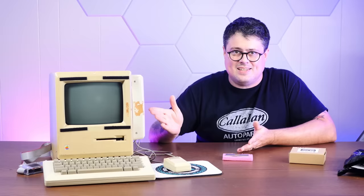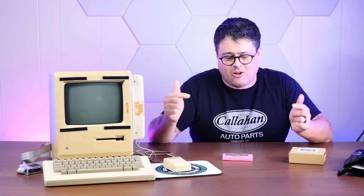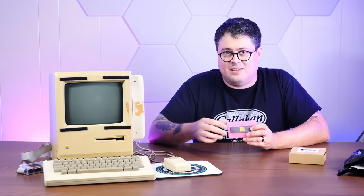I'm pretty sure that this 68010 will mostly work in this system and even give it a bit of a performance boost. Although I've never heard of anyone trying this upgrade in the Mac 128K, I have read accounts of people installing these things in their Mac Pluses — those are the upgraded 68000 machines that came out instead of the rumored Turbo Mac. I'm not sure why Apple never actually switched to the 68010; my guess is price. The 68010 is basically a bug-fixed 68000, but Apple just ignored all the buggy features and built macOS around it, so there really wasn't that much to gain from switching. So now let's right that wrong and make ourselves a super janky Turbo Mac.